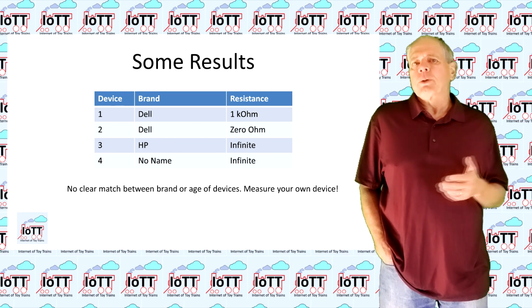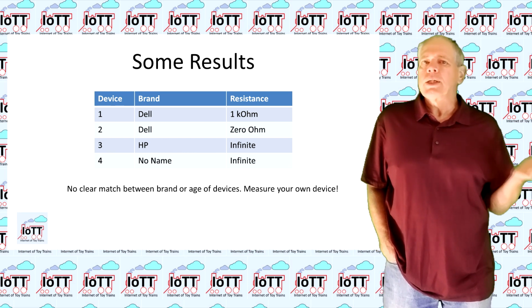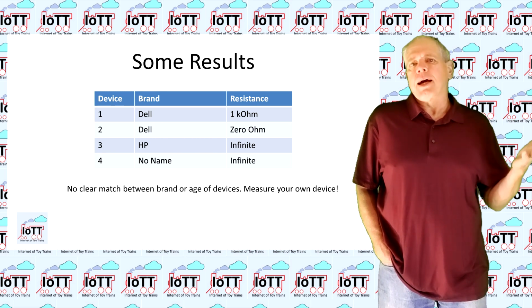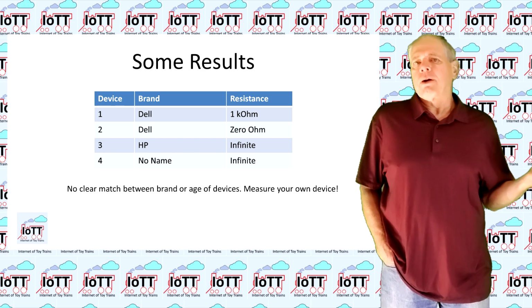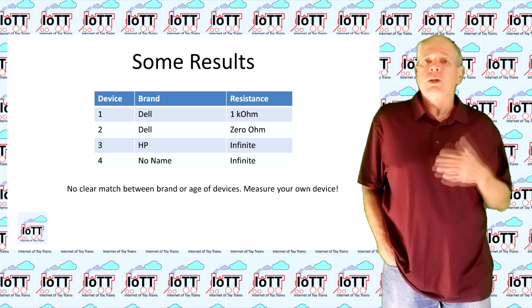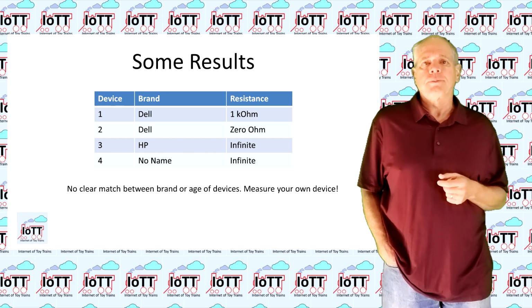I was not able to clearly establish rules who is using what, but it seems that my Dell power supplies have a grounded negative output, while the ones from HP are floating. But then there are exceptions, so it's best to check for yourself.